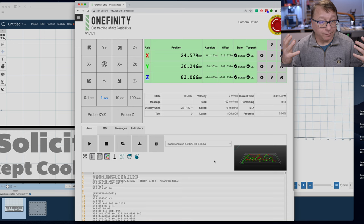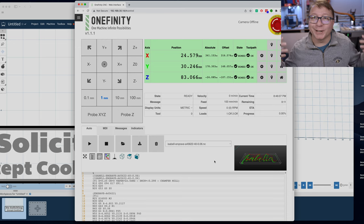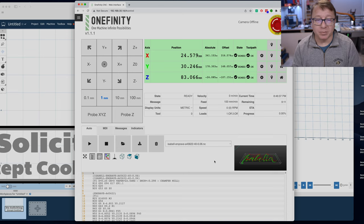The next step is to get the material mounted on the machine and get the G-code uploaded to the Onefinity. If you have an X-Carve or something like a Shapeoko, you'd get the G-code to your machine using a USB stick. But because the Onefinity is on the network, I can just pull up its user interface and upload directly from my computer — super easy. I have the machine homed and zeroed, which should be awesome. If you're not familiar with the terms homing and zeroing, I'll link to some videos below so you can get familiarized with basic CNC terminology.